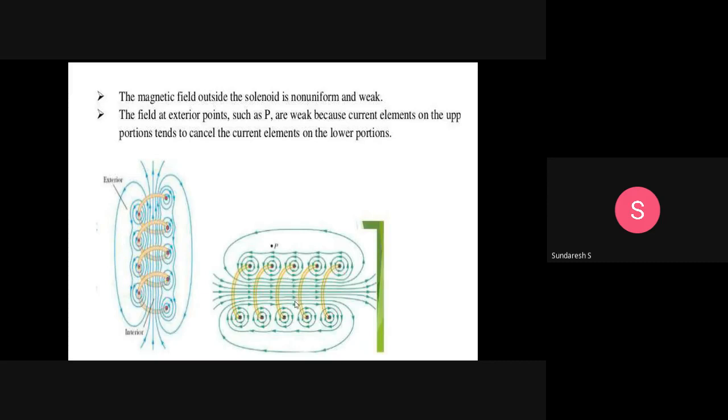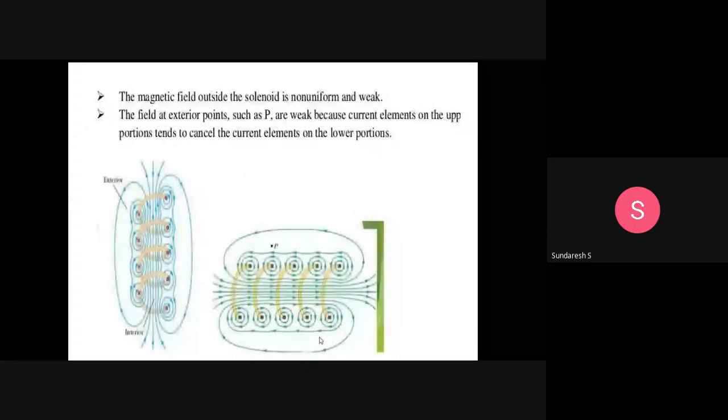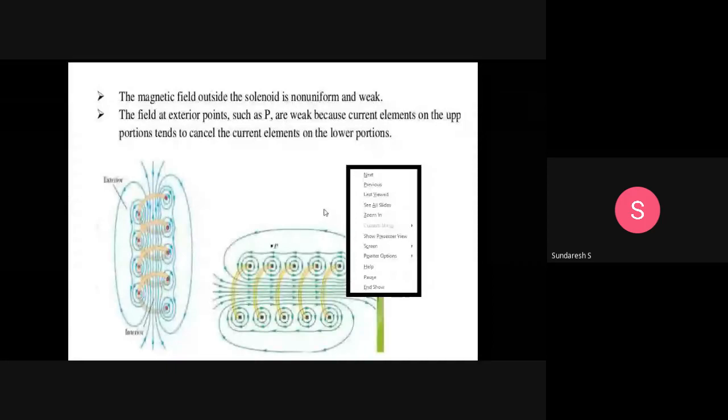This is just like an electromagnet. Solenoid coils formed in the form of a helix will produce a magnetic field when a steady current flows through them. This magnetic field is the vector sum of all the magnetic fields resulting from each coil, and these magnetic fields are parallel to each other and uniformly distributed. This is what the diagram shows you here.